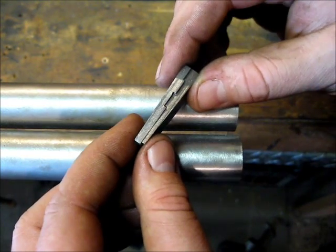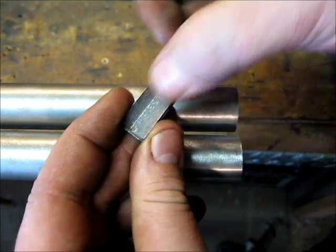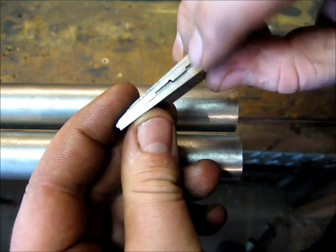Starting this week with the regulating wedges. The way these are made is I do most of this in my mill. I run a ball mill down this to get close to the radius of the barrels. And you can see it's made in two parts, and the parts are keyed together.